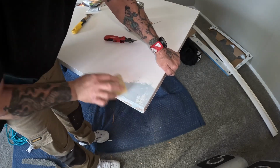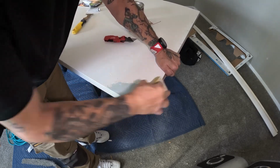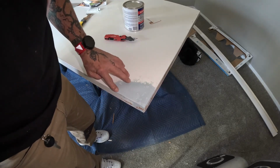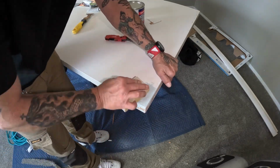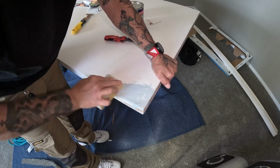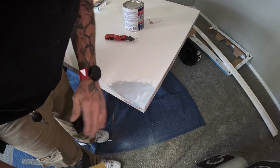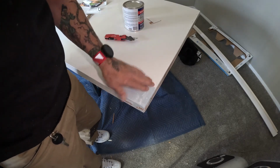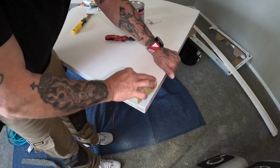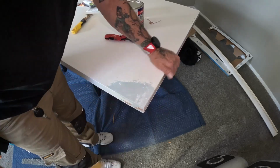It could use a little bit more time to cure up, but it's pretty good. And if you get it like this, it's just a little dippy, and then I can still see this rim. But if you sand it, that just gets worse. Just put another little thin coat on. Before you know it, you'll be Bondoing cars. Because the dry time is 10 minutes, and this has only been sitting here 10 minutes, and you can see how it's got dimples in it. So what I'm gonna do is clean it up a little bit, and I'm gonna put a real tiny little light coat on there.